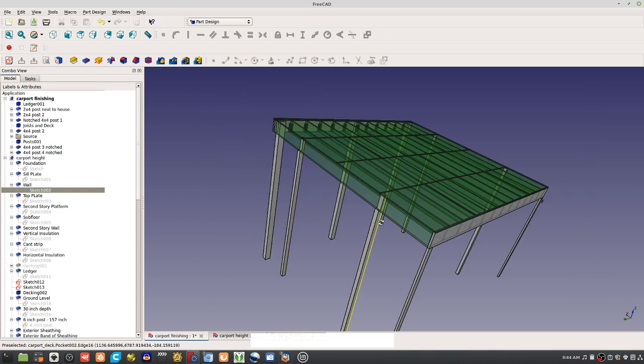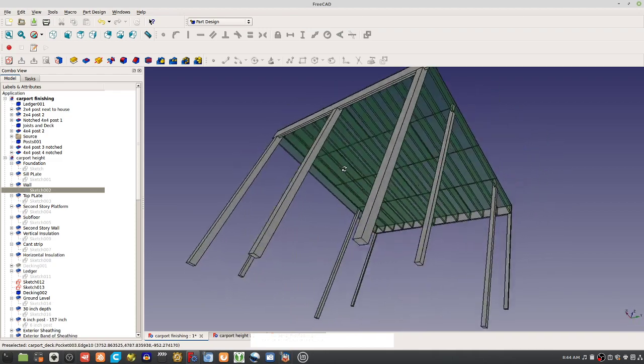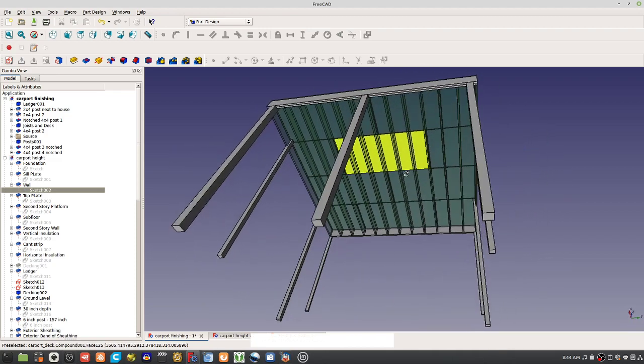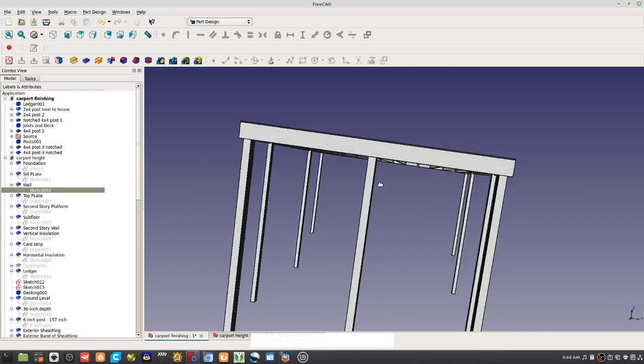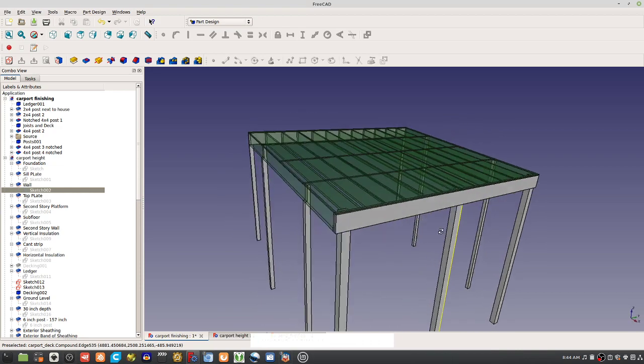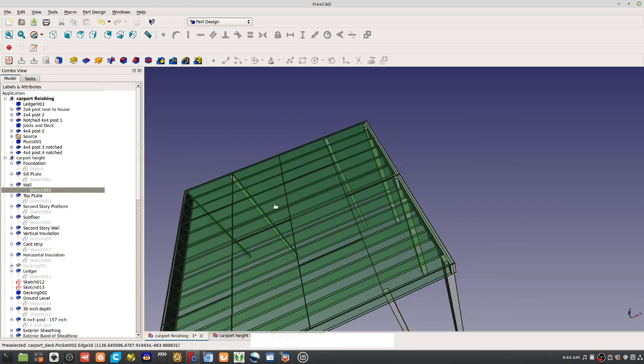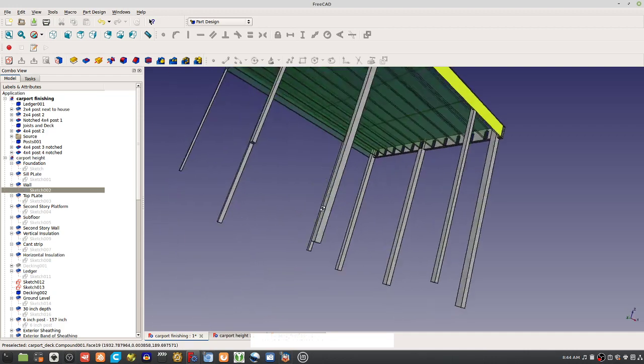And then from there I just drew it out. It's a similar kind of truss structure. Now the trusses, because this is raised and it's basically EPDM and platform on stilts here, by code the spacing actually has to be a little tighter.